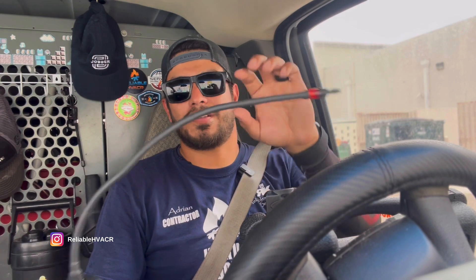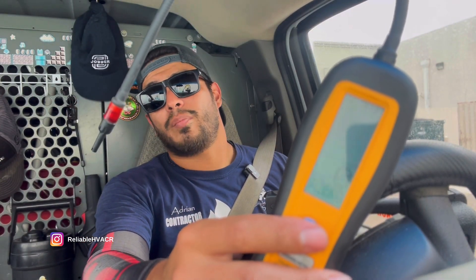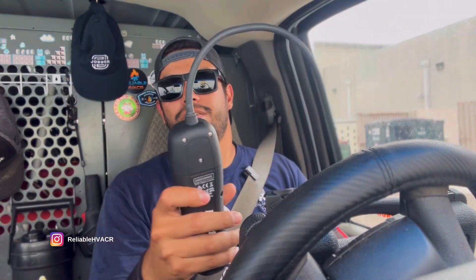The lighted tip is the greatest feature ever — you've got the tip, the beeping sound, and the blue backlit display that gives you the reading as a big digital number. You can auto-zero or manual-zero. For sensitivity, I use it on high, and if I need to pinpoint a leak I lower it — go medium for a general area, then low to find it right on the dot. If it's a really hard one to find, try turbo mode for super high sensitivity.